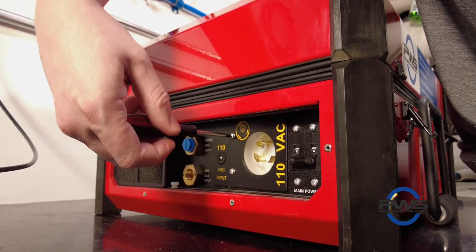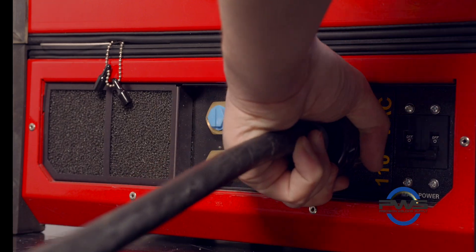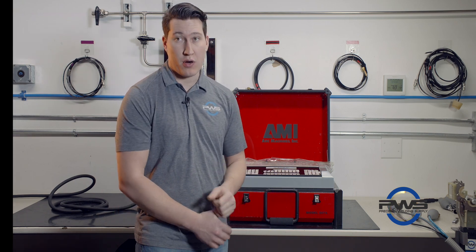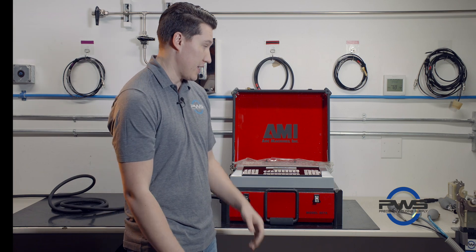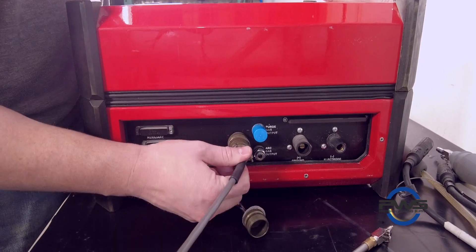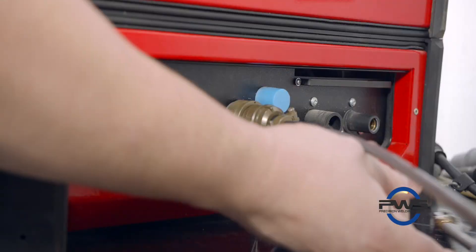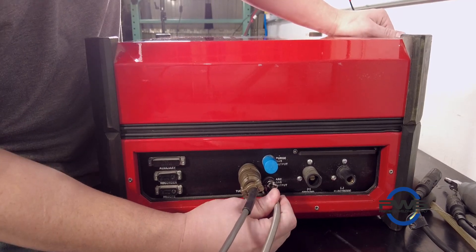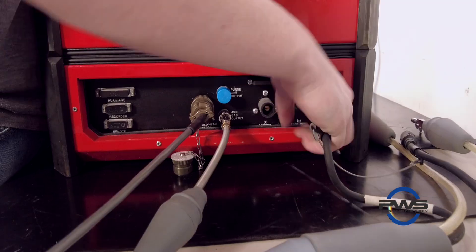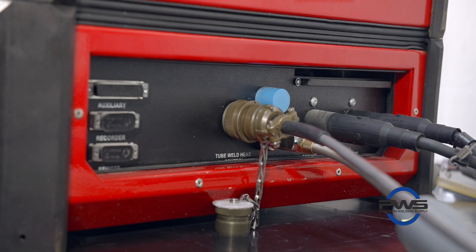Today we have it set at 110, so we're going to plug that in. We can plug in our weld head using either a 15-foot adapter or the small 18-inch jumper adapters. If you use an 18-inch adapter, you're going to have to plug your gas and your control cable or Amphenol directly into the machine. If you're using a 15-foot adapter, then you're going to plug all of the leads from the weld head to the adapter, and then the adapter leads will go directly to the machine. All weld heads come with a 10-foot lead, so you always start off with that.